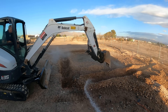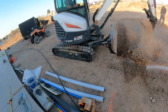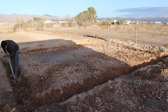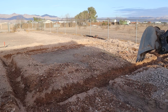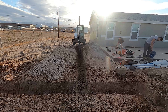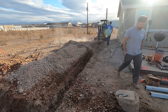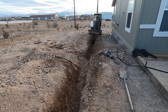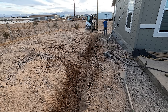As we dig this out, I'm adding water and spraying it down just to keep the dust down and also to help firm it up — the more water I can get in there, the better. Now that we have it all dug out, I'm cleaning up the loose stuff and getting all the spoils out of the footing so we have a good base. This particular trench is going to be my electrical — I'm going back to the power pole with a one-inch conduit, sweeping it up into this foundation right on the edge wall, about two inches off the edge so it'll be within the wall and the sub-panel will be within the wall.